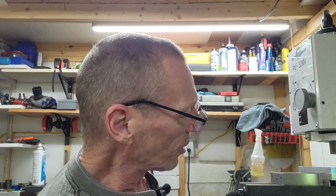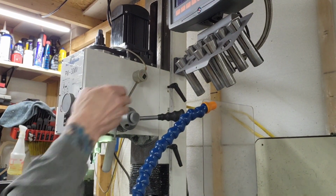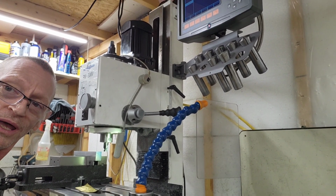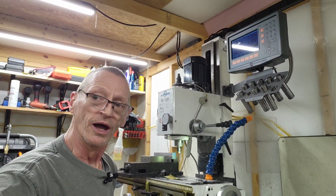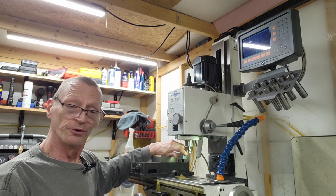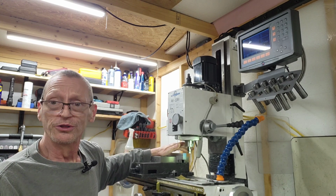We're going to cut this backside first. I'm going to move over so I'm cleared. I clear the part. Now we're going to drop down, bring our head down. We're going to bring the Z down. So my Z is zeroed right at the top of that part. Let me back this up, zoom out a little bit. Okay, I just want you guys to understand this completely. So we have touched off the top. So we know our 0 dead at the top. We know our depth is 390. That's where I'm going. They have a minimum depth of 370. I can go to 380 and be in the middle.